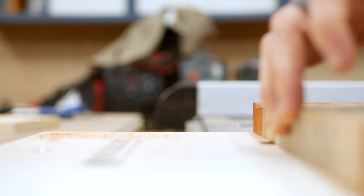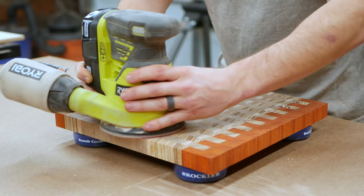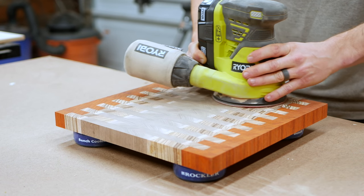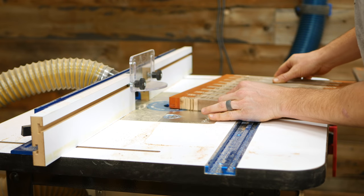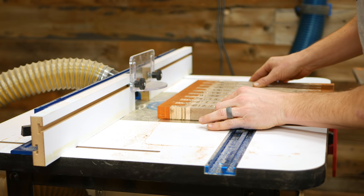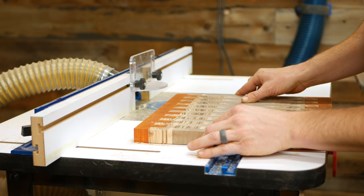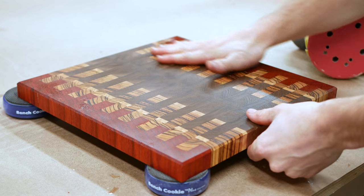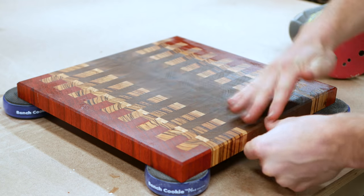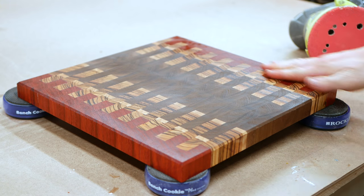After squaring up the sides, I did a first sanding pass on all surfaces with 80 grit. The finish was actually pretty smooth already from the planer, so it only took a few minutes. Before moving to the next step, I decided that a very light chamfer on the top edges was the best solution to bringing out the beauty and the profile, which I did over on my router table. I then wet the entire piece to raise the grain and sanded back down so that when it got wet for the first time in use, it wouldn't become rough to the touch.